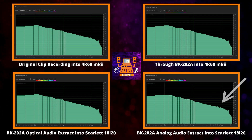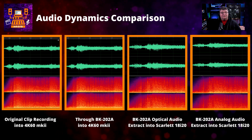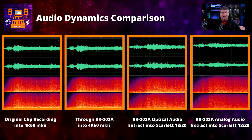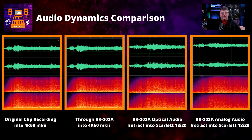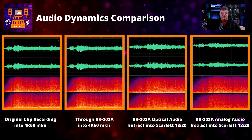There was a slight bump in the presence that I could hear in the analog, and it is visible in the analysis, but it's very minor. Overall, the conversion was really good. Looking at the dynamic range comparison, we can see the original output through HDMI as well as optical are virtually identical. There's a slight drop in dynamic range with the analog output, which comes through a built-in digital-to-analog converter, so I expect it to be somewhat different. The best choices are going to be digital audio output.